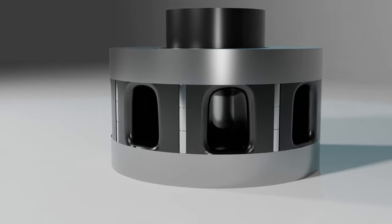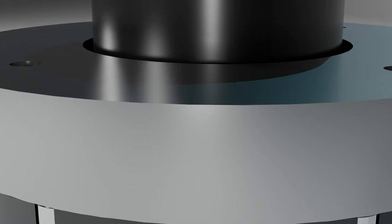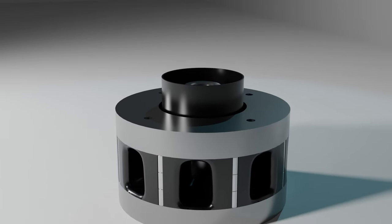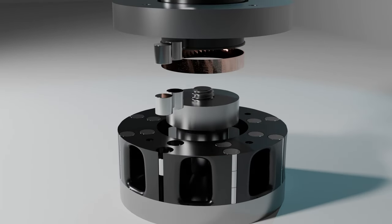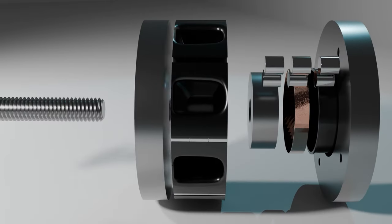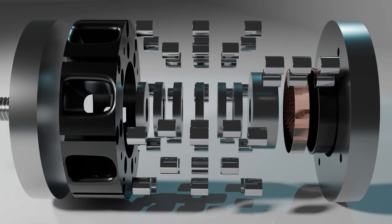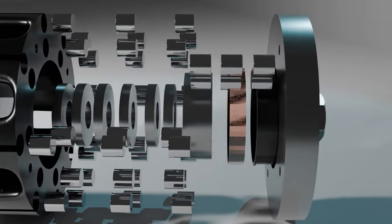The motor of this driver is built around version 14's vented design. It uses far more magnets and is significantly taller than version 14 though. It uses three stacked magnets to gain height, as well as increase saturation in the plates. The core components, though, are still similar to version 14. I'm still using laser-cut plates, however they are thicker this time to make the underhung design function properly.